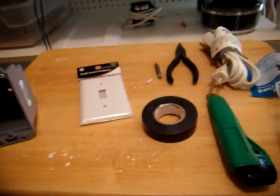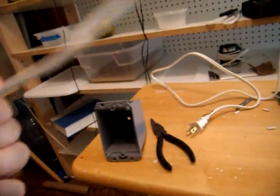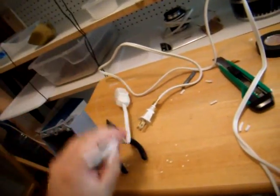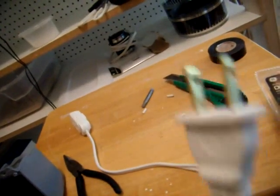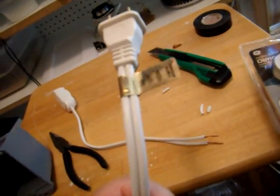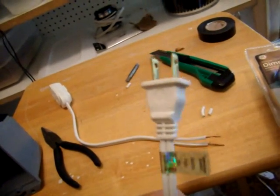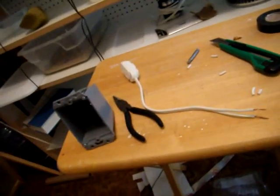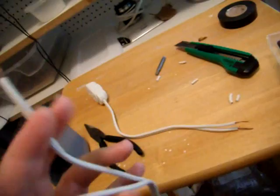First thing we're going to do is cut the cord and separate the cables. You go to the second bend on it, cut off this piece, then split it down the middle and strip the wires. Now if you look at the cables, the hot end — which is positive — is the fat one. It's got ridges around the outside, whereas the other one is smooth. That's how you can tell which cable is which. The polarized one is the hot cable — it's the positive one. You don't want to cross them, otherwise bad things can happen.